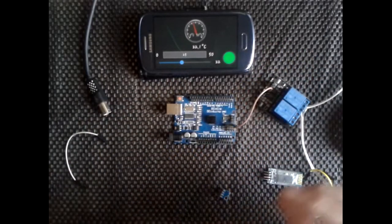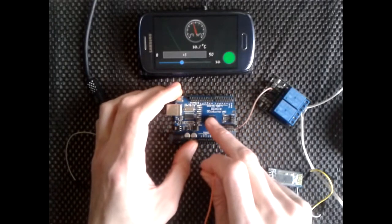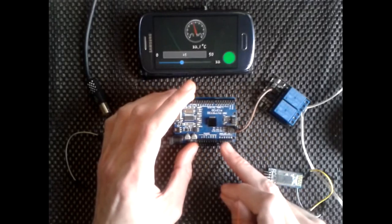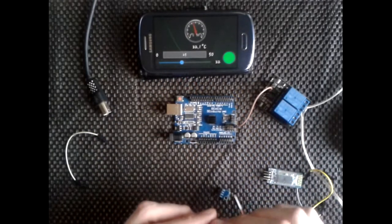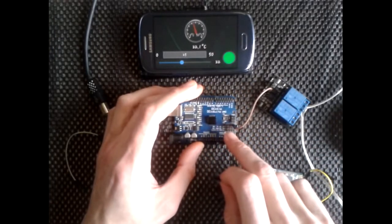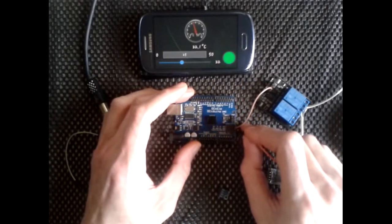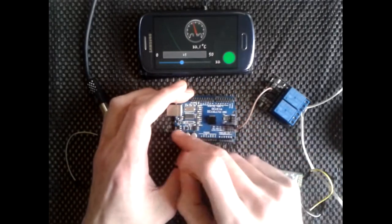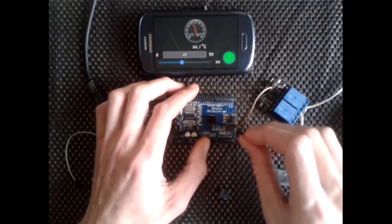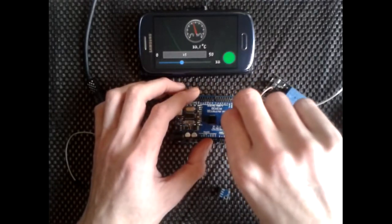on the Arduino. Be careful where you connect these, because like I say, on some boards it might pull the voltage through the actual chip itself, the ATmega. I'm not certain on that, so don't take my word for it. Just take it as a precaution. Like I say, this board's unique in a way where it's actually got a set rail here, and it'll take the power directly from the actual voltage regulator itself, which is rated to 1 amp. I know that because I've looked up the data sheet, and also I do supply these, and I've popped a few as well. But yeah, they deliver up to 1 amp anyway before they start getting warm and toasty.